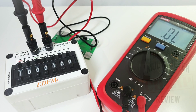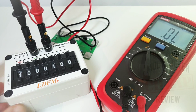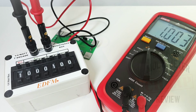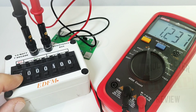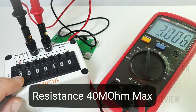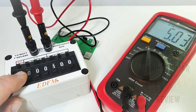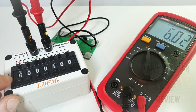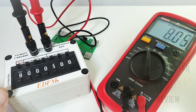Running a quick resistance test starting at 1 megaohm — spot on and fast. Two megaohm, three megaohm, five megaohm — we're losing resolution now that we're over 4 megaohm since this is only a 4,000-count meter. Six megaohm, nine megaohm — nice and fast, no worries.